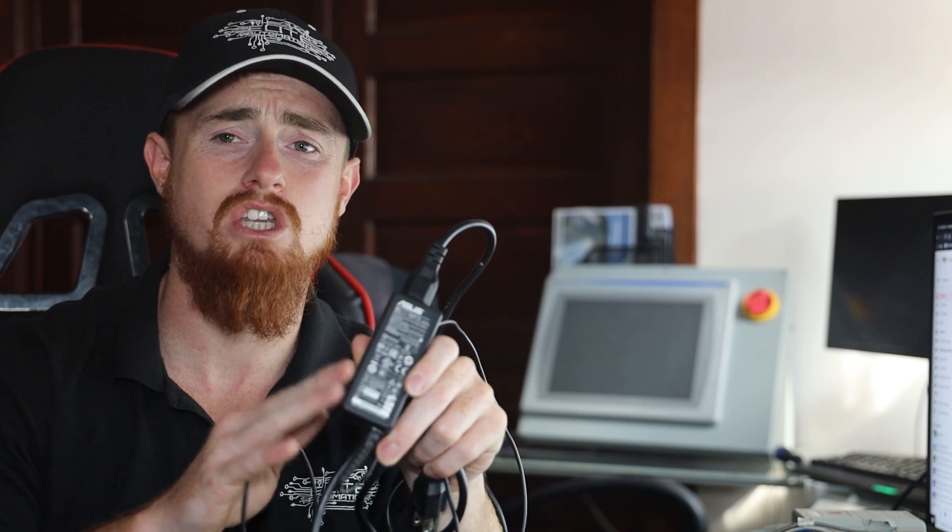Whenever you're picking these up, there's a few things you need to be worried about: the voltage output of this device and its current capability. Generally, anything that's going to be like a PLC is not going to take too much power, so you generally don't have to worry about that unless you're powering a bunch of different devices. But you do need to check, because for some odd reason this thing may be good for only half an amp at 12 volts or at 24 volts. Just a disclaimer — a lot of these are going to come in around the 19-volt range. Some of them are 12 volts, some can be higher, but you just need to look and see what you've got.